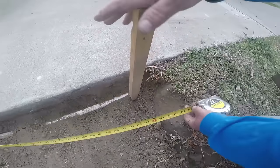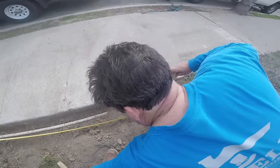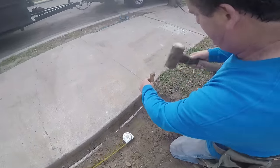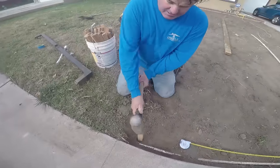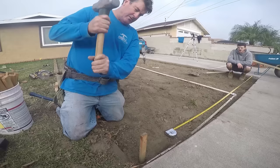Some people put the lines on the back of the form, which is amateur style. Every stake you drive in interferes with your line that way — you really don't know what's going on.